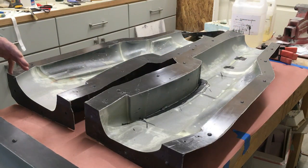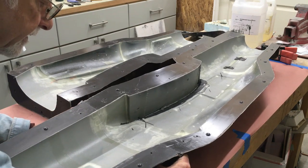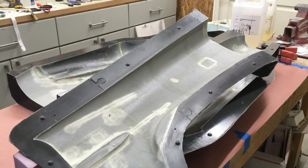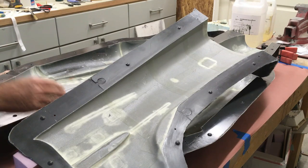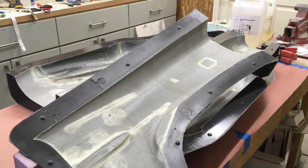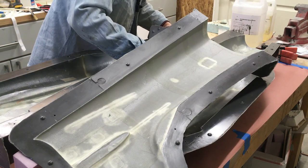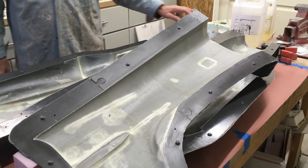Because this is going to be basically a five-part mold joining, I'm going to quickly test-fit to check that all the alignments are good and nothing is interfering. If it interferes you can get bulges in the side walls, which don't look pretty once you've cracked the molds open — the part can come out looking bumpy and bad. Nothing is interfering right now. Checking the front as well — nothing's compressing, the side walls are all adhering to each other, so everything should be good.